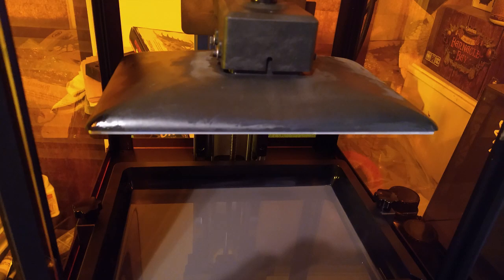The printer is nice and smooth going up and down, and the noise is just fine. It's got a level plate by default. Normally I re-level, but for this review I decided to trust Epax and just leave it. I've done weeks of prints without touching the level at all, and it absolutely works — the factory level was dead nuts on. One of my favorite things is actually the build plate. It's plastic with metal weld in the bottom, and it works fine. The big advantage is that it's hugely sloped, so all that resin drips off — every last bit. I've never seen a printer that had so little resin pooled on top.